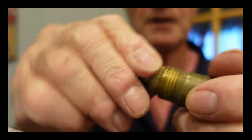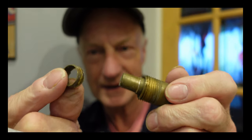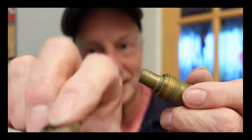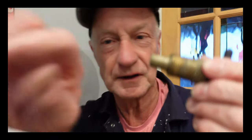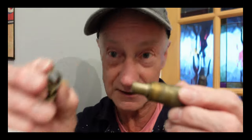Look at that — and the olive is in there. I'll undo it to show you exactly what happened. Just take the nut off and the olive will be crushed up on there — right there she is. What a simple piece of kit that is. It works and it does a fantastic job. So if you want to get an olive off a piece of copper tube easily, then this is the little tool to use.